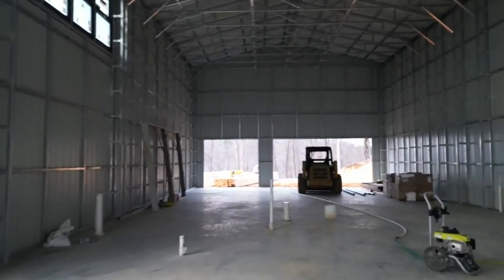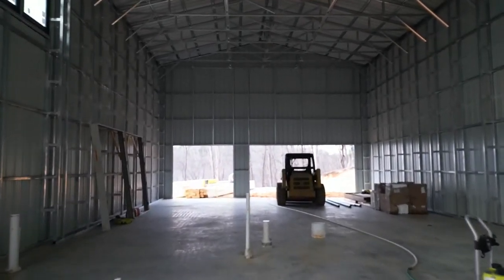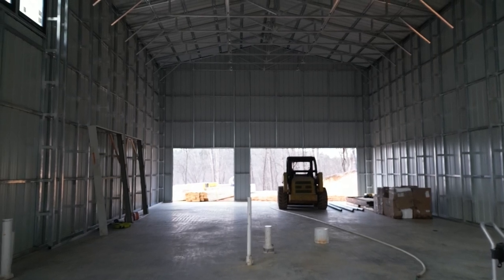This is considered a risk category 2 building. And that's important because category 1 is like a carport. You don't want to live in a carport building. It's going to blow away. It's like tornado magnets. They just get hit, and they're gone.